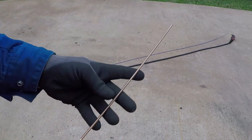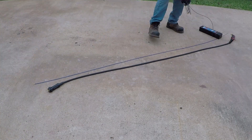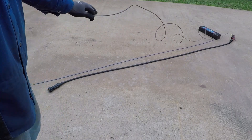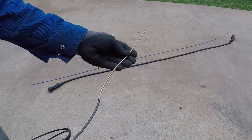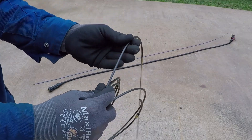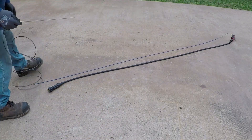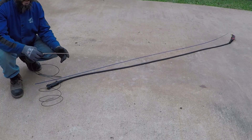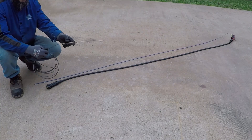I will lay the new liner next to the original and make sure it's longer than the original. This is a brass-looking spring that's going to go at the torch end. It's about 24 inches longer than the original, so it's going to work. Some liners just come made from one material without this spring, but this is a better quality liner for MIG welding aluminum. At the torch end it's going to get hot, and this may damage the liner if it stops right at the tip — that's why they supply it with this spring.